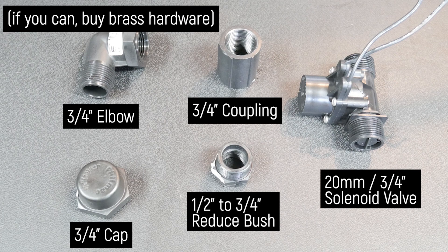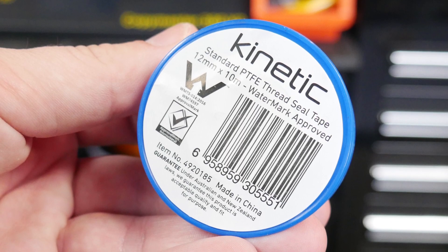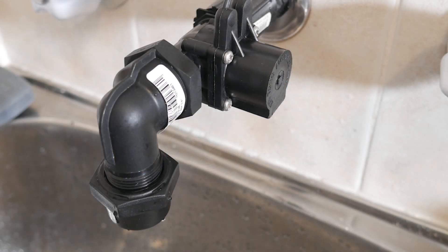These are all the parts you'll need to recreate my setup. Feel free to adapt what you can find, and if you do venture to a hardware store to piece your system together, please take necessary precautions. Mains water pressure is also surprisingly high, so also grab some thread tape to help seal against leaks. Brass fittings would have been better in my opinion for a long-term solution, but plastic is all I could get hold of, and it'll last long enough for most cases.